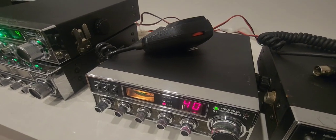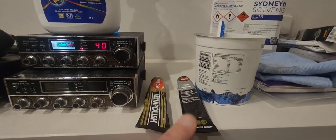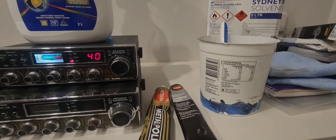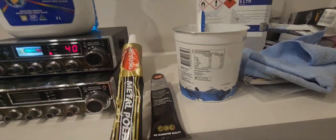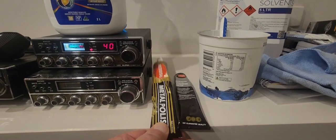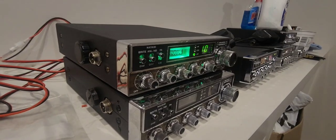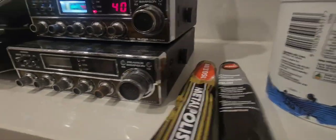On the top I've polished the top covers with what I'm about to show you. Once you've cleaned, what do you do? I have two products: Autosol metal polish and Autosol aluminium product. With the aluminium product you need to be very mindful that you start with clean rags - the rags I use by choice are microfibres, purchased in packets from various sources. It is quite abrasive so you've got to be very careful.